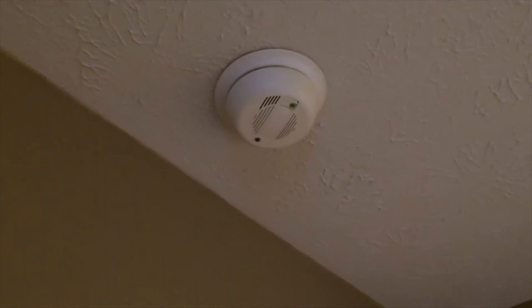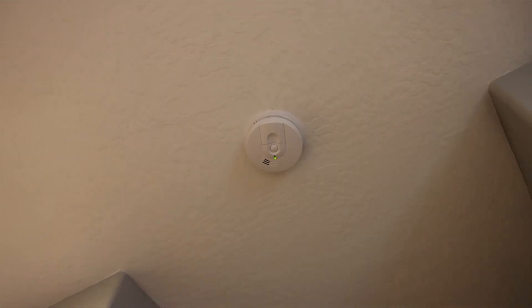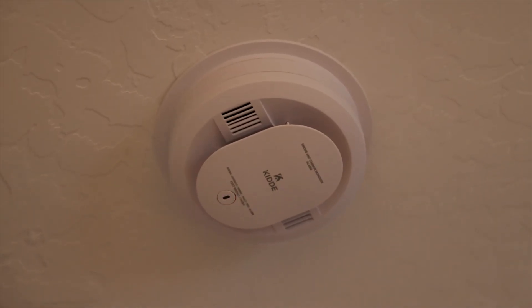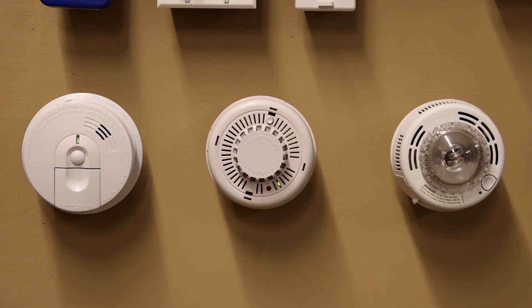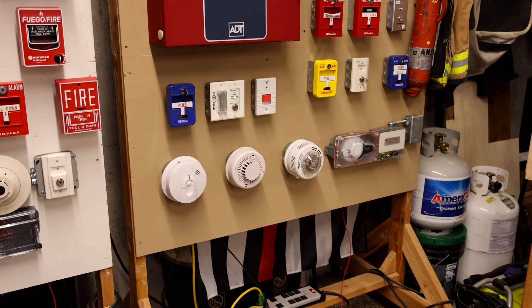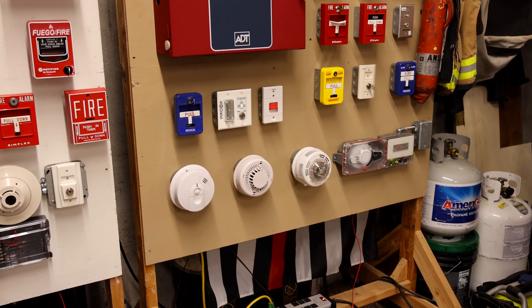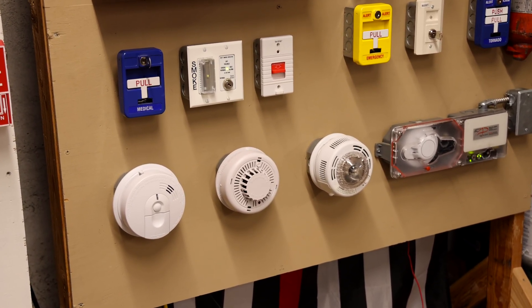The problem is the way that alarms interpret signals — and the signals that they send — can differ based on brands. To go a step further, when these alarms are undergoing their UL listing and doing testing, UL will usually only test the communications loop between alarms of the same brand. So by introducing another brand into the circuit, UL is not going to guarantee that the alarm will communicate properly. In the past I have intermixed different brands on the same interconnected circuit in my own home and found that communication works just fine — so this is not a '100% of the time it won't work' situation. However, I have many times come across different brands on the same circuit and found that they haven't worked, and that's what I'm going to show you today.